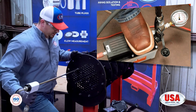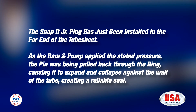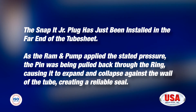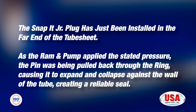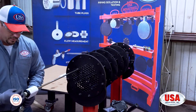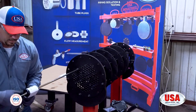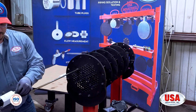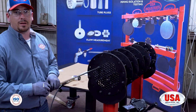After you run it up a second time, you are going to decompress. When taking everything apart, you are going to first remove your safety cable — back the safety cable nut off and take off the safety cable. Then back off the expansion nut. You are going to remove the RAM from the Channel-Head Pull Rod Assembly with your spacer. When you are removing the Channel-Head Pull Rod Assembly out of the ID of the tubes, please be aware of the reverse thread stud.